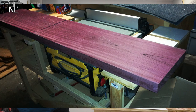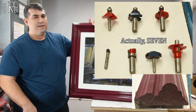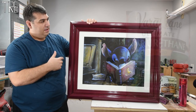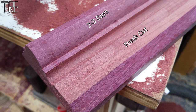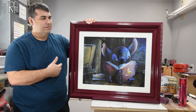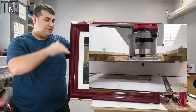The original piece was about 11 inches wide and five feet long. I ripped it into three strips and milled it out. This video is all about that milling process — it took a combination of five router bits to get this profile. I sealed it with an oil-based polyurethane with UV protection, exterior grade, to help keep the color. When you first cut purple heart it's a bright purple, goes a little red, then back to purple, and eventually goes to grays and browns. I had to build a gantry to run my router over the top.